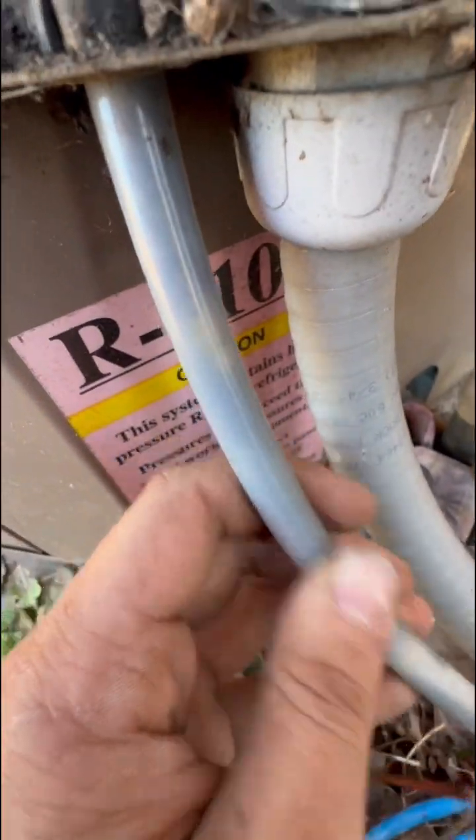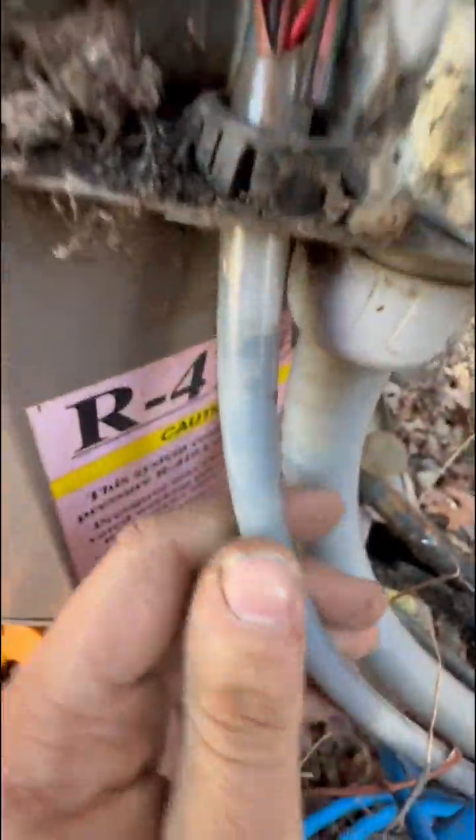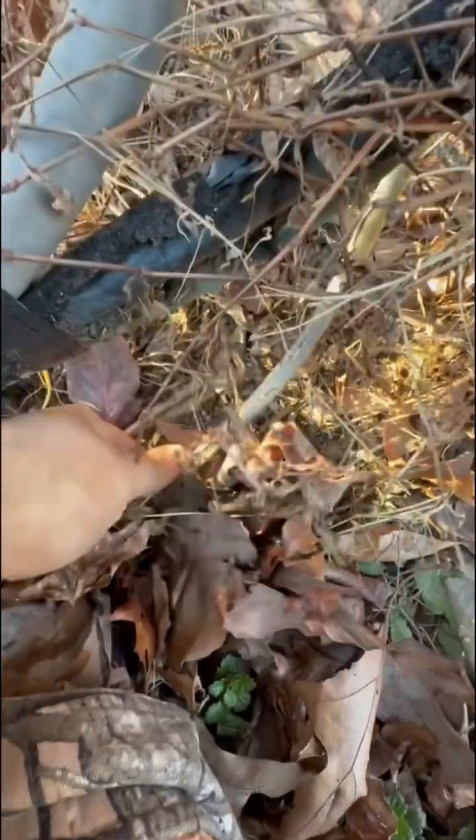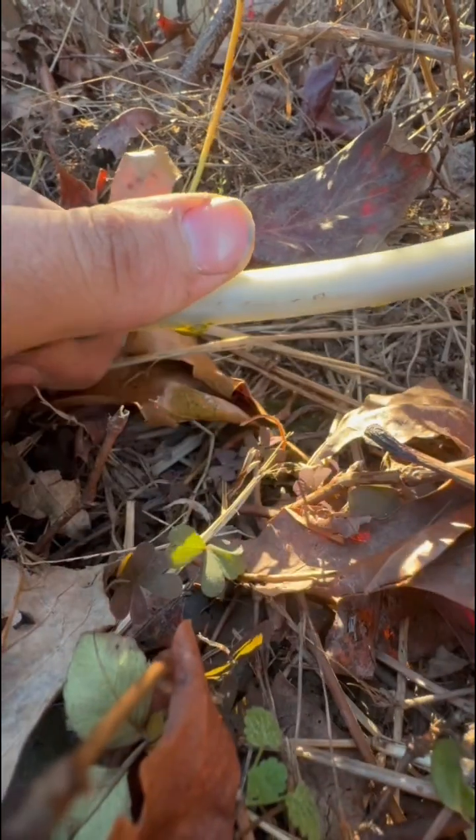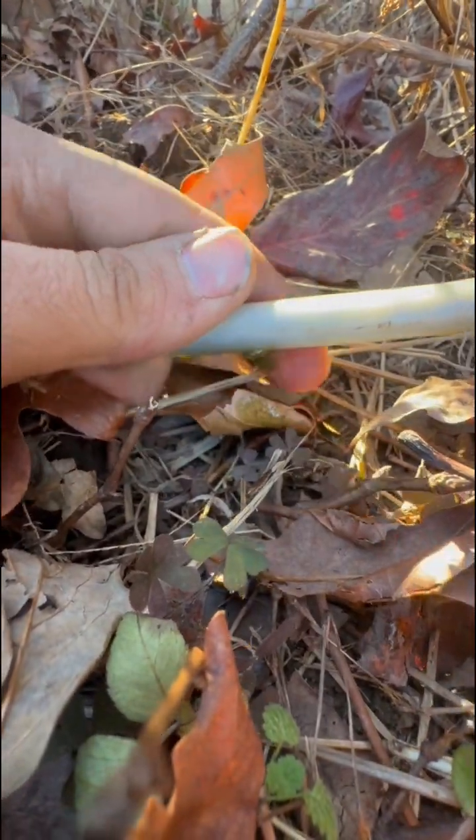There's a ton of water all the way up inside this tube that's covering the thermostat wire. Let's drain it. It must not crack easy. There we go — we started to drip. It has stopped. That sucker is filled with algae. That's why it ain't draining too good.